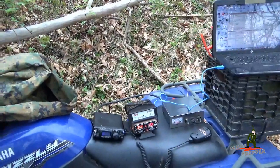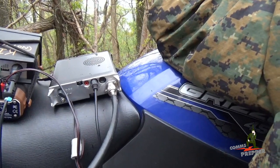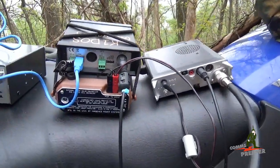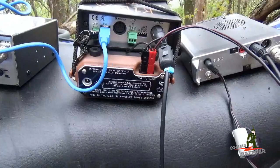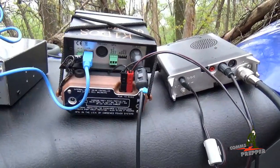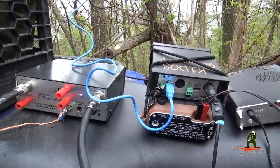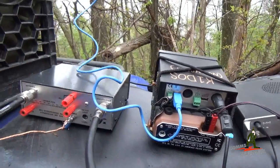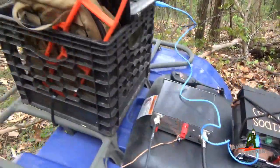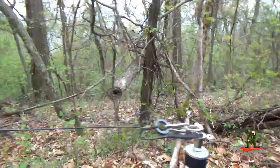Now I'm going to walk behind the ATV here and show you the connections on the back of all this equipment. On the rear of the 817ND, I have a data cable, power cable, and RF cable. The power cable goes to the back of the QRP Ranger, and that unpopulated plug is the DC wall wart charging port where you can hook up a 12-volt solar panel and charge the QRP Ranger. I bring the RF over to the back of the tuner. The tuner makes the antenna look correct at 50 ohms for the radio. I came off the port here with the counterpoise off the ground post on the tuner, brought the coax around, and connected it to the hybrid micro base, and then we ran that wire out as a long wire.